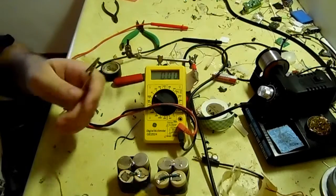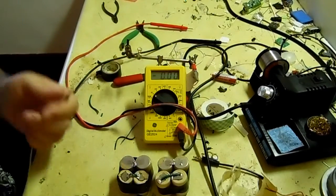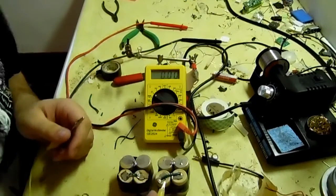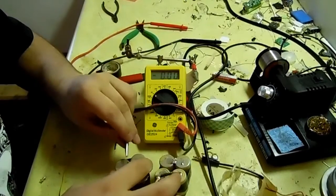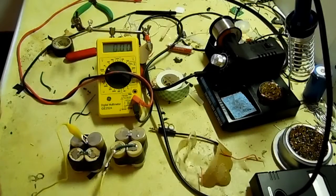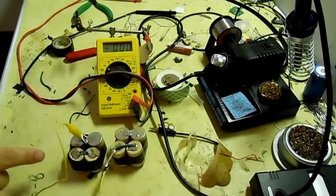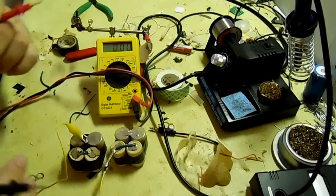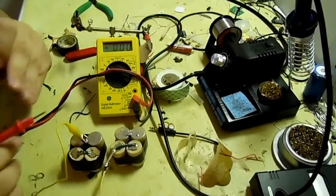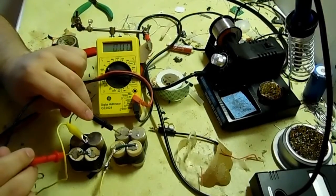So I'm going to take this gator clip and connect both these packs in series to get the high voltage we would need to control the Dremel at high speed. So we take a positive and connect it to a negative. This mechanism right here shows both batteries in series, which is what you would want on high voltage. So this becomes the new ground. The positive output is the same. So we're switching ground and disconnecting a series pack. So it's really not that complicated, but again, it's confusing. So now we should have double the voltage, which should be right around 5 or 5.1.